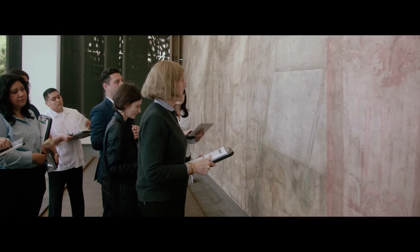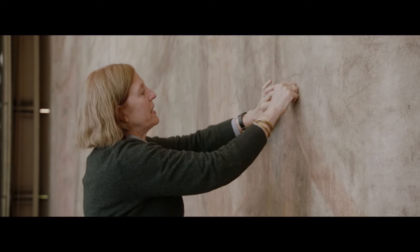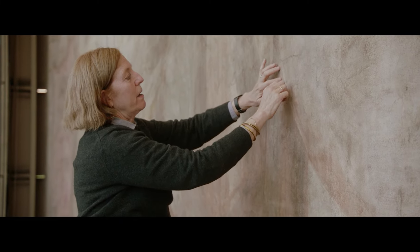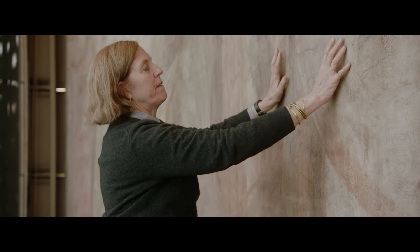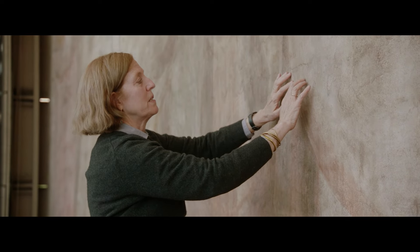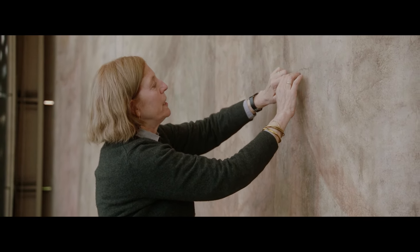We want to just take a picture of that. Tap just lightly on the mural. If we find a place that sounds a little hollow, this is probably stable. It's a very small, limited space. But if we felt like the plaster was detached and it wasn't stable, we would either find a hole along a crack where we could insert a syringe needle, or we would drill a very small hole.